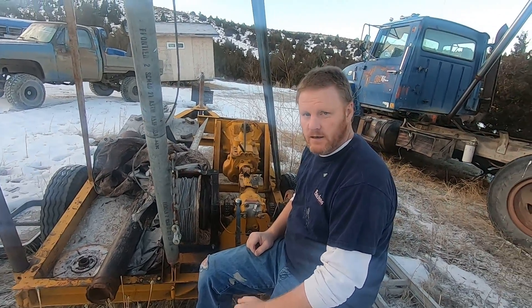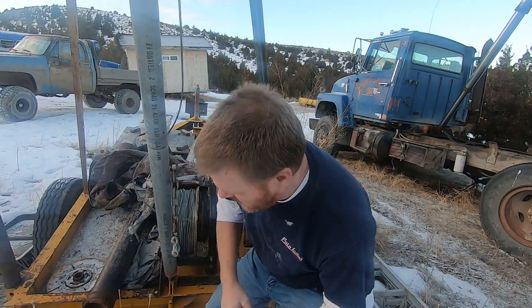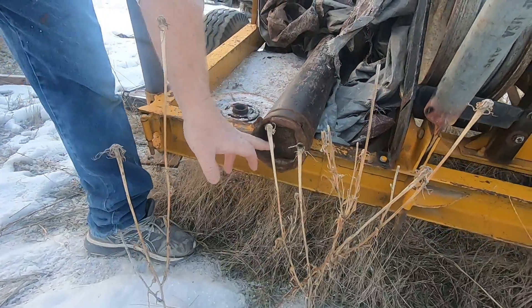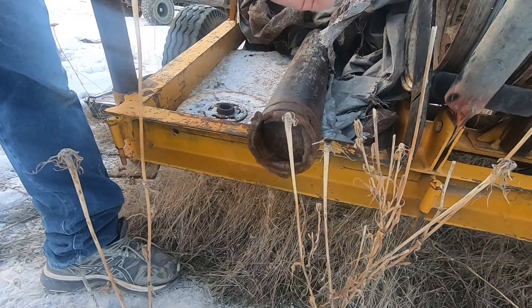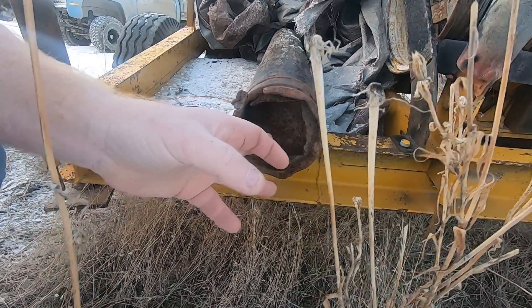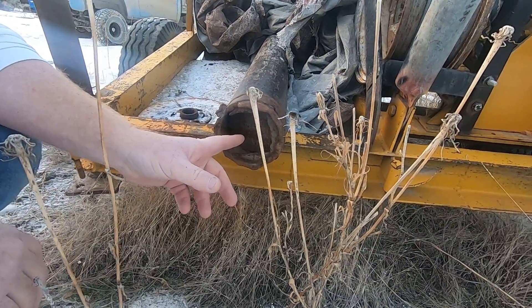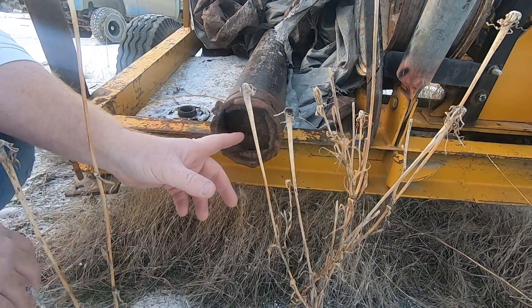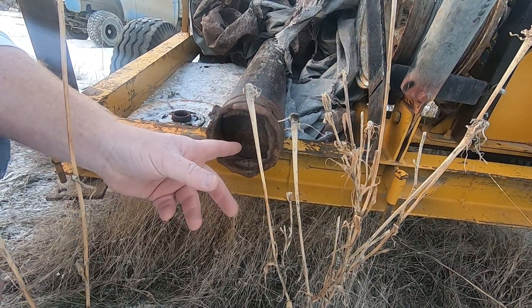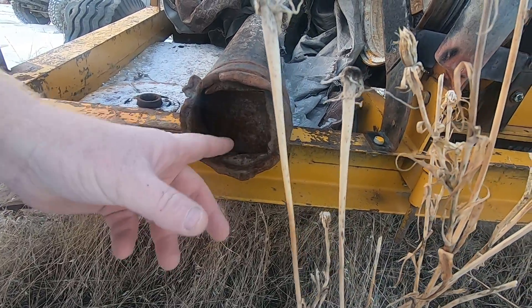This was a cable tool rig — the idea is to just add water in the hole, pulverize everything at the bottom, and then use this little mechanism here. You put that on the end of your cable when you've advanced a foot or so and made a bunch of mud at the bottom of the hole — you send this down and suck it out. There was a real major flaw with this: the metal flapper here seemed like every time I made mud, this bit would get stuck.